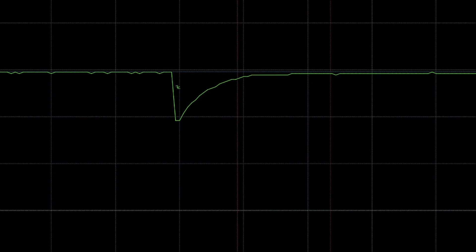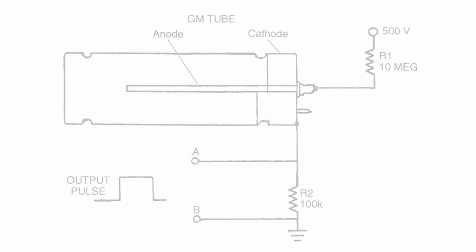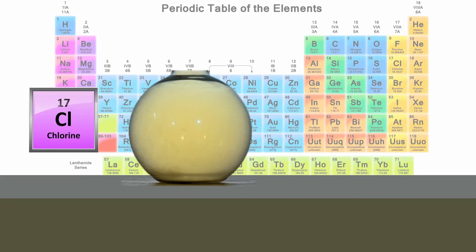And this brings me to a critical part of the circuit: the anode resistor. This has two main functions — firstly, it limits the current that can pass through the tube when it is ionized. The second important purpose is that it helps to perform something called quenching. Quenching is the process that stops the ionization process from continuing indefinitely. Without quenching, the avalanche cascade breakdown would just continue and the tube would then become a simple discharge bulb.